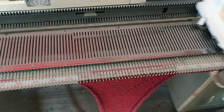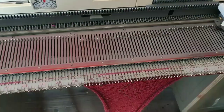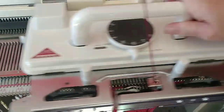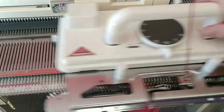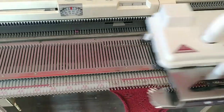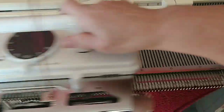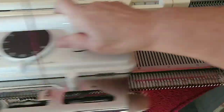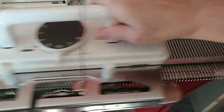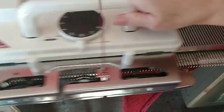What we found is that the adjustments have to be made according to the carriage and the bed that you're working on. We did a video on how to make the adjustments on the carriage, and I matched them to one we knew was working. We brought it up and it was working. This one was doing something — it was lifting the needle, moving the needle, but it wasn't transferring the stitch like it should have. And I looked at it, and there is a timing to these lace carriages. Everything is done in the sinker plate, not in the carriage.